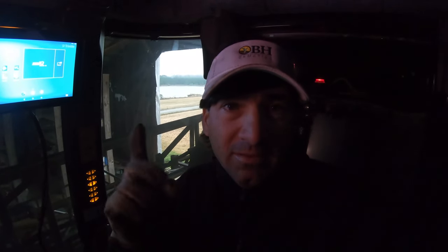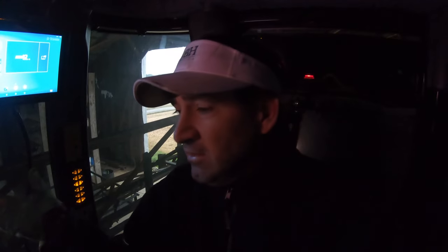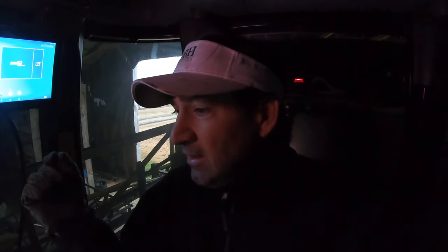I'm just gonna let that run. It cranked up fine. What the mechanic found out is there's something mounted on here that is associated with Ag Leader, where basically they can look at my screens and see if there's any codes popping up, or they can communicate with this machine wirelessly from their parts stores or dealerships. Apparently they've had trouble with that, and what AGCO told them to do was disconnect that because I don't use it. So the mechanic disconnected it, and it was drawing power down.